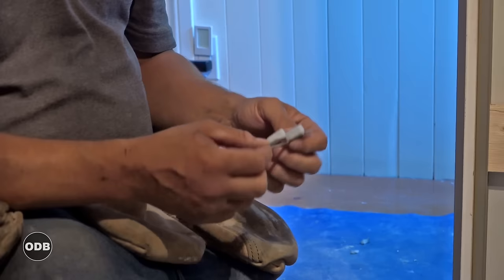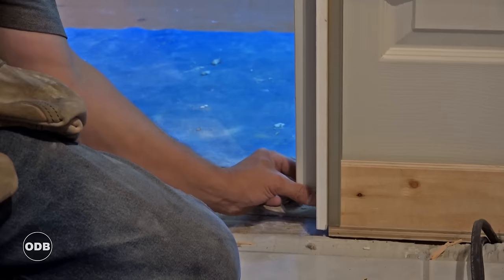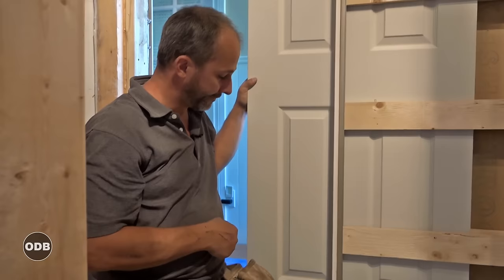The last finishing touch is the little bracket at the bottom. It does two things: it has little plastic slides so the door doesn't make noise when opening and closing, and it's also a spreader that establishes the correct gap width for the door. Set it wherever you need, and the door will slide quietly. Once that's on, choose your finishing hardware — round pull circles, options with locks — it depends what you need.